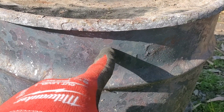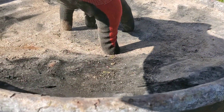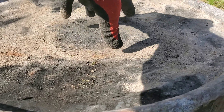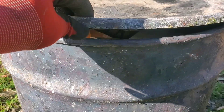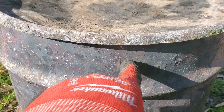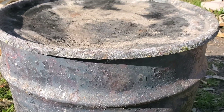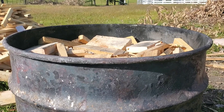I need to leave an inch or two of headspace to account for the deformation in the top of this lid. It's lower in the center because I place a heavy weight here to help seal it while it's in the chamber. So long as I have good metal-to-metal contact between this lid and the rim of this barrel, I'll be able to exclude enough oxygen from the contents and pyrolysis will be able to occur. I will rig this up now so I can get a starting weight of this raw material.